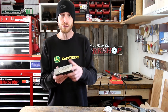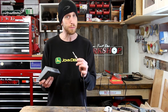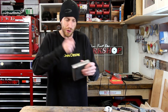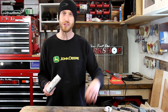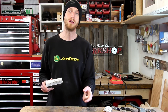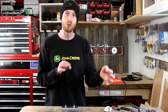This is going to be really cool. I'm looking forward to getting everything fine-tuned and dialed in. Now, just in case you're wondering why I decided to add a jack to the back and have a separate cable rather than just hardwiring everything - I don't like the hardwired ones because the cables always end up getting wrapped around the box and strained, and it ends up ruining the cable - hence the pedal we started with. I like it being separate because if you ever have an issue with a cable, you can just get a new cable, plug it in, and you're good to go. I always carry spare cables with me anyway. And if I ever have an issue inside the box, I don't have to worry about the cable when soldering and unsoldering anything for repairs.